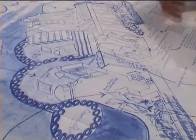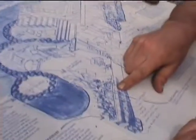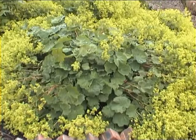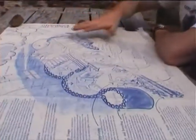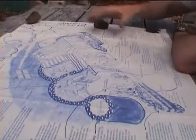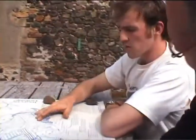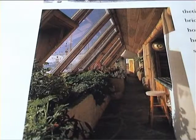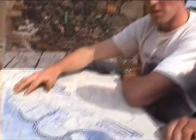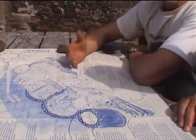The systems are quite separate from the earthship thermal mass concept. Systems of water catchment and the planter beds within the earthship, together with the power, allow this thing to be autonomous. The U system is built around the orientation and your latitude on the planet. For instance, if you're building in New Mexico, which is closer to the equator, you have your glass slanted at a certain orientation to the sun in order to allow the sun to enter at the appropriate angle for maximum solar gain into all of the thermal mass.